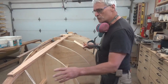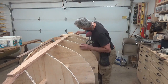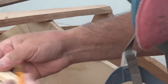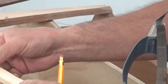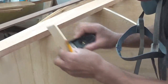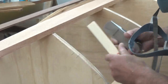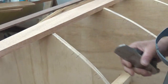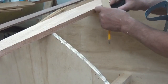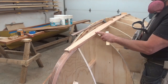I'll just work my way along. I'm going to do a couple of sections because once I get plank number one on, I can just work my way down. Up in the middle here it's not really going to be an issue — plank will land nice and flat across there, no problem. Back in the stern portion there will actually be a bit of a gap underneath, and that's fine. The planking will just go from the landing point to sit on the hog. That's much better on that one. Work on this number one form — maybe a little off of this one as well. Next will be to shape the hog to accept the planking, so this has to lay flat down onto the hog. I'm going to get out the bigger plane and start shaving off.